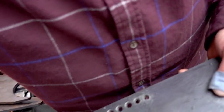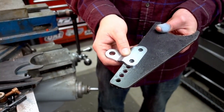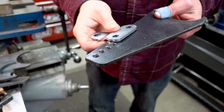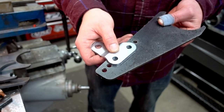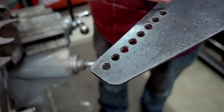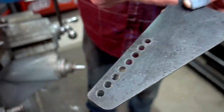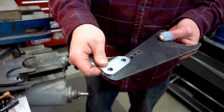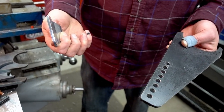These are for the shock mounts — we're welding these onto the rear axle. This is going to give our coilover suspension adjustment so we can dial in the ride height of the car. These are all half-inch increments. Then there's another one of these on each side, and that's how we control the ride height of our coilovers.